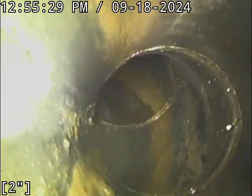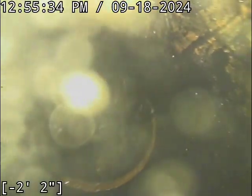Anyway, the best way to keep your lines clean, if you're new to homeownership and aren't familiar with grease buildup, the rule of thumb I tell most people to live by is: if you have enough grease or oil on your pans, while the pan is hot or warm anyway, that if you were to turn the pan sideways it would run off the pan in beads, actually flow off the pan, that's when you want to let your pan cool down, wipe it out with a paper towel, pour it into a jar. A thin little coating of PAM spray is no big deal. Hot water and soap handles that.